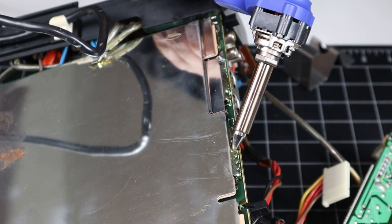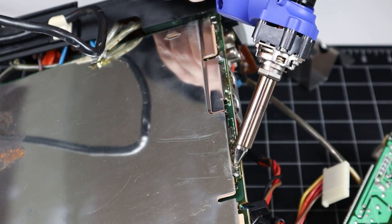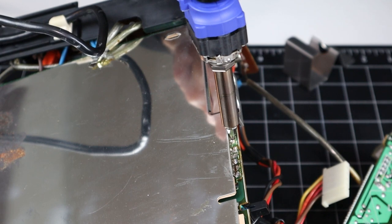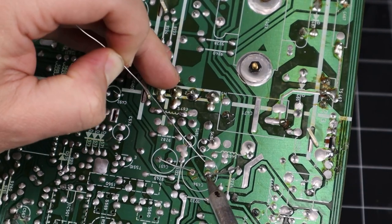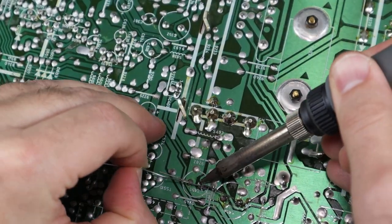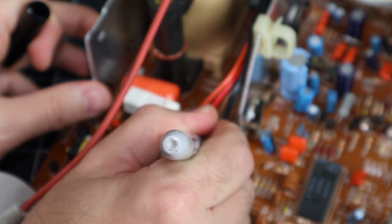As I mentioned, these displays are easy to work on. There is one annoyance though, and that's the RF shield — it's soldered on in a whole bunch of places, and you have to be gentle removing it or you can rip up the ground plane on the motherboard. Also be on the lookout for tabs that are both soldered and twisted in place. Fortunately, I ordered a lot of extras when I recapped my old display, so I already had both of these caps on hand. And as always, I like to mark the new parts so I know they've been replaced when I look next time.